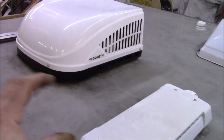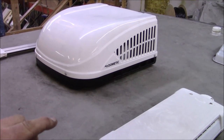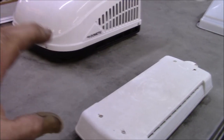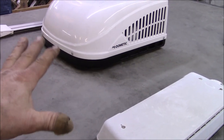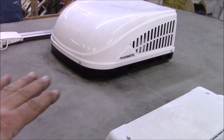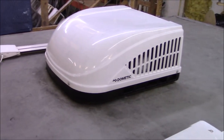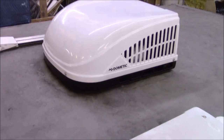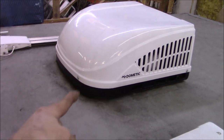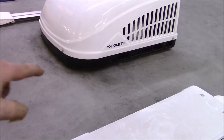He said even though they do the roof, you may still experience some leaks, and what he recommended was to go in and tighten up the bolts. This is what's called a compression fitting — inside on the sealant is a square plate that has holes in the four corners, and when you tighten it up it pulls down, squeezing together. But by the time we put it up on a curb and snug it down, you don't have any issues because the water would have to try to get around inside there. When I put it on a curb it's going to have counter flashing up underneath this white lid.